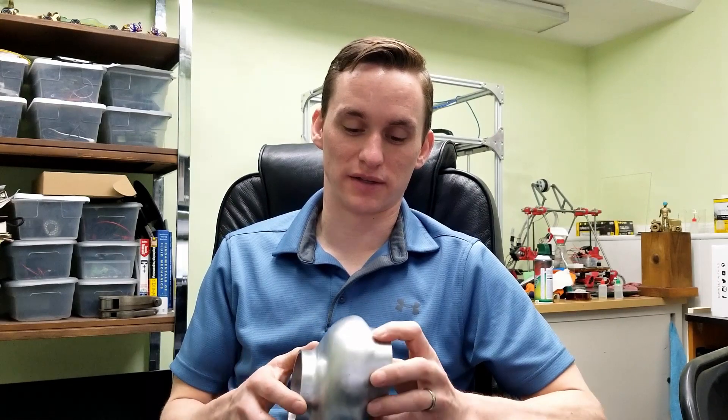Next thing — if I had redone that spot where I had the hole in the mold, I should have taken some green sand and packed it in there instead of using play sand, thinking that was going to stop the aluminum from flowing through. It didn't even come close — it poured right through that play sand like it was nothing, obviously like water would flow through it. Other than that, the result wasn't terrible. There's obviously a lot more finishing work than I wanted, but it's the first shot at doing something like this in this shape.